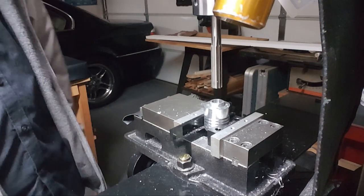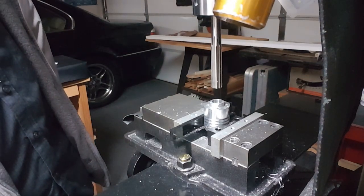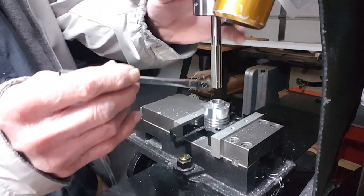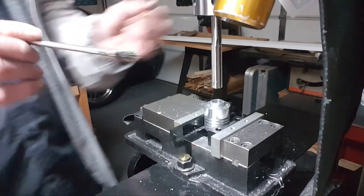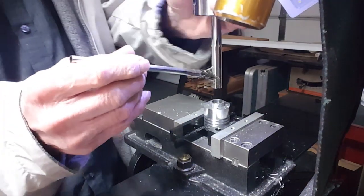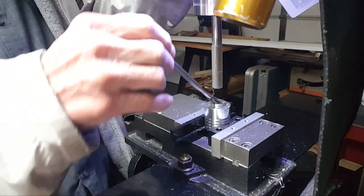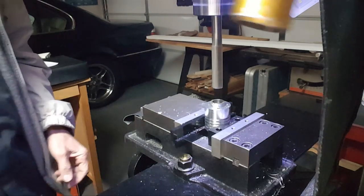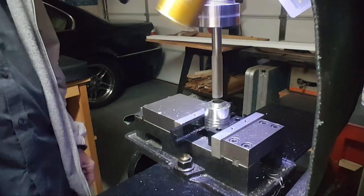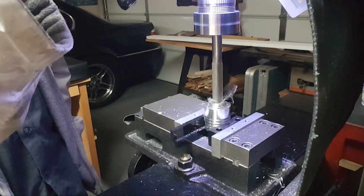Alright, this is it. Reamer time. 1/2 inch reamer. And it is a nice USA made one. Plenty of... Hey, it's locked up still. Alright, turn this thing on. Give it some RPM. I want lots of oil in there. Low RPM and go in slow. It's the only way you're going to get a really nice cylinder. Drill bits don't do it.